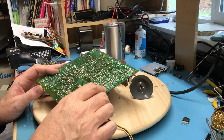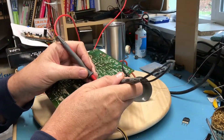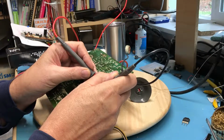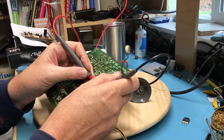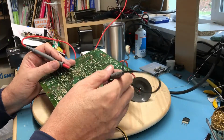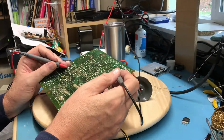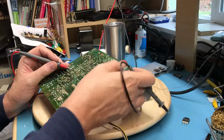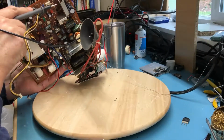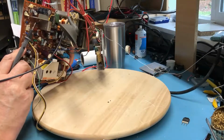Sync. It's a jumper. That's a diode I don't remember looking at, though I probably did. It's another Zener based on the symbol. It should be 4.0.5, and then there's something charging behind it. But that looks good to me. There's an IC here that, if it's shot, who knows? Is that a connector or an IC? That's actually another IC. If either one of those is dead, we're pretty much out of business.